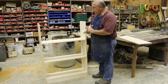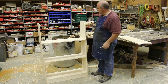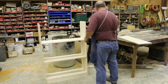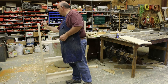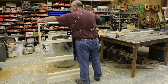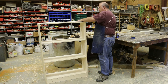Now we're ready to put the top shelf on. This is a rabbet, not a dado — it's not closed on the top, the top is going to be open. But still we're going to put some glue across here and put some screws in there just like the others. Make sure we've got a good even coat of glue in there on both sides, and the shelf drops in. I'm not so much worried about clamping this top shelf — we're going to let the screws do the clamping power for us. We'll pre-drill them and then screw them in place.